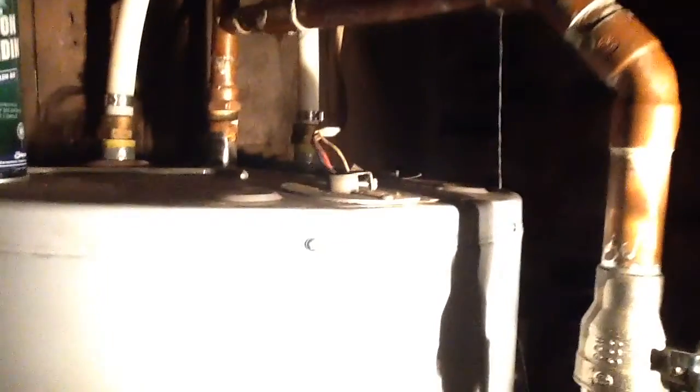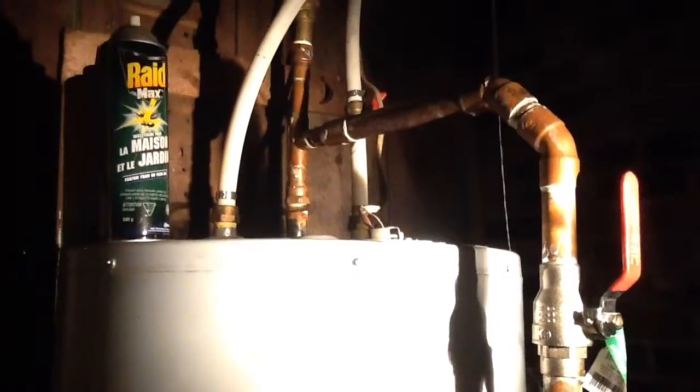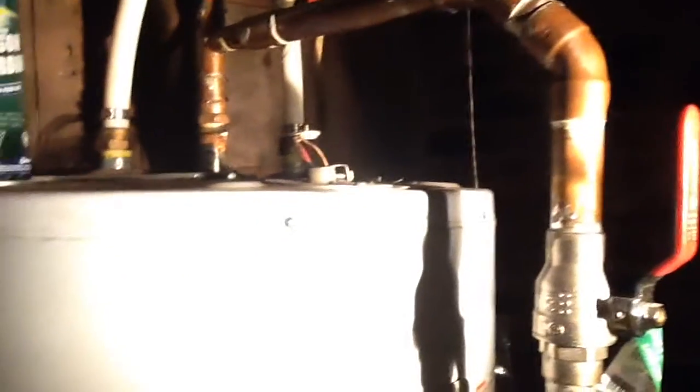The second issue is that our electric hot water heater stopped working. I have this Hotpoint unit here which serves as the hot water boiler and it's plugged into 240-volt AC. I turned the breaker on — it shows as on — but it wasn't heating the water. The temperature wasn't cold enough last night to really heat it up either. I turned it on, checked back in an hour, and it still wasn't hot. So I need to take my voltmeter and check the 240-volt line to see if it's actually getting power.